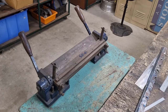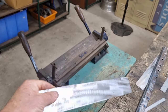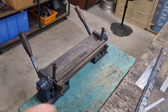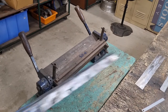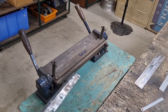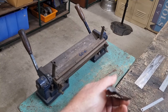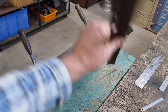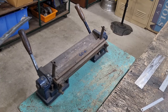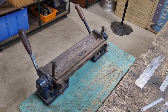Okay, so I was just marking up the two bits of steel that Sam cut earlier, marking where the folds need to be. And I got a little folder there. So my little brake only folds 405 millimeters wide. So luckily these pieces are about 385 mil wide. So I've just got to make, not that, as I was showing before, just got to make that. And they're not sharp bends, so I'll just have to play it by feel, I guess. You can learn with me.